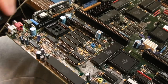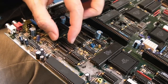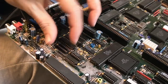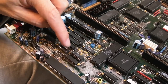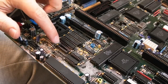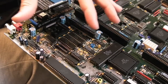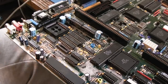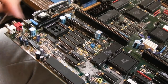Another quick tip, and I'm not sure I've mentioned this one before: when you're soldering a couple of solder points to hold your socket in position before you flip it over and inspect that all the pins are in and your socket's level, don't solder diagonally opposite VCC and ground. I always solder, like, the second one on this side and the second one on that side. Something that's not connected to a giant rail, because then if you do need to adjust it or completely remove it, it's far easier to get off.